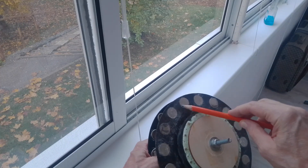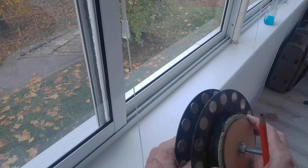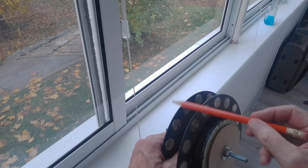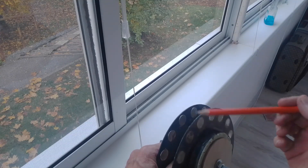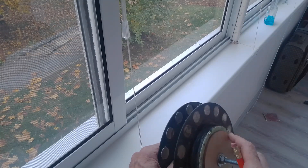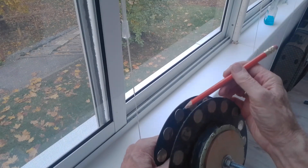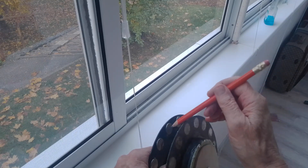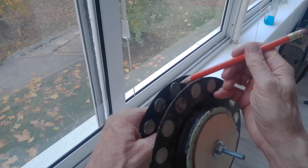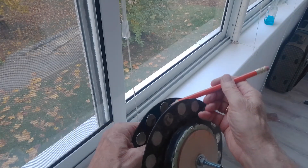Also, these are all facing the same direction — north, all the way around. They aren't alternating north-south. So another thing I could do is put this right in between there and see how that goes as a generator — this one will induce and this one will induce, and it should create AC because one side hits the front and the other hits the back of the core. The edges of the magnets are where the power is — the center of the magnets is kind of like the eye of a hurricane. So on a scope, when you see the peaks, it's when the edge passes by, and there will be a little double peak as the magnet passes by.